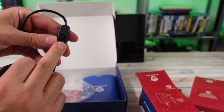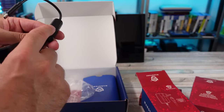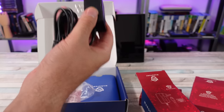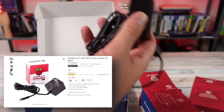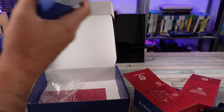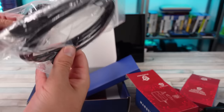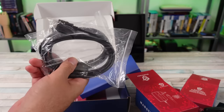I like using a script with something attached to the GPIO. So use this responsibly — whatever operating system, whatever front end, shut it down within the software and then power it off. Don't just be like "oh, I'm done for the day, let me power it off" — you might corrupt some stuff. Power supplies are usually like eight to ten bucks. And then we do get right here two HDMI to micro HDMI cables — that's what the Pi 4 uses, kind of sucks, but they gave us two of them. You can get two Pi-branded ones for $15.